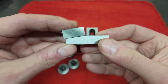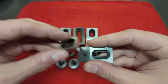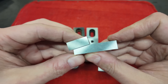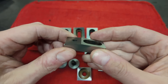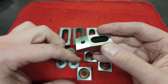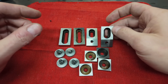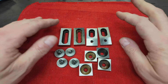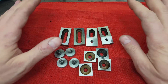These are supposed to be those slanted toe clamps. One of these would sit on top on the slanted part, and the cam screw would screw in through here and into that tapped hole right there, which would cause this piece to move forward and down when the cam was activated. However, when I drilled and tapped this hole I did so before I set the part up for the slanted surface, so this drilled and tapped hole is now at the wrong angle. Long story short, it doesn't work. I mean, you live and you learn. I'm certainly not making them over at this point — the grinding was brutal and I am just absolutely done.